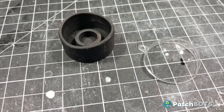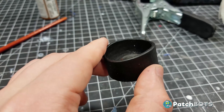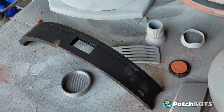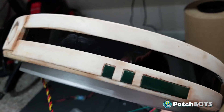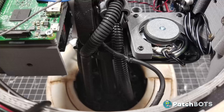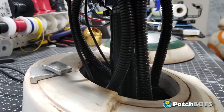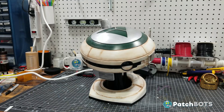There are a few parts that are custom to this build. The first is the eye — I wanted to have a clear lens in there so I bought these little clear plastic Christmas ornament halves, dremeled and sanded it down until it fit into the socket, then covered it with the little printed half eyelid piece. The visor is pretty cool too — I printed out the main block and then covered it with a welder's mask cut to shape, which gives it a nice glassy finish to look more like a real visor. Plus I can mount the lights to the back through this hole, which will look pretty much like the movie. We also need to add some convoluted tubing around the neck to fill out this space and give it that L3 look. I installed mounts in the base of the neck for the tubing and some smaller holes to route larger gauge wire, and also printed some internal hoops to string wire through the head to hang down. With all of this installed, we're ready to give L3 her first full test.